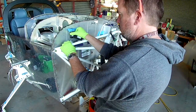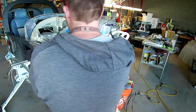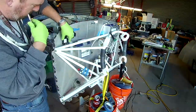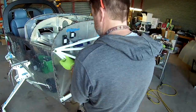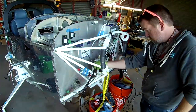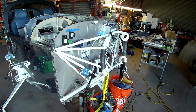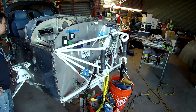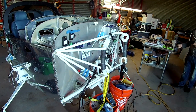All right, so here is where I'm going to try to put the manifold pressure sensors. You already saw me just tape up the fuel filter on the bottom. So there's two fuel filters in the system. It's got very fine injectors, and you need to have good filters. So it's going to live there, roughly, because the oil cooler is going to be sitting next to it. And I've got to get a fuel line from the firewall to the bottom side of that, and then another line out of the top side of that over to the number three cylinder. And I've got to get two manifold pressure sensors. You can see them sort of up there on the firewall now.